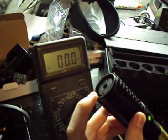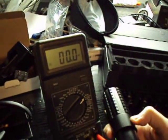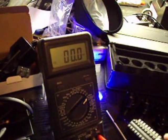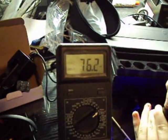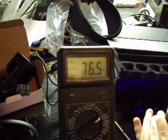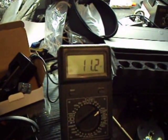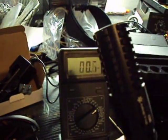Now let's do some measurements. I've taken out the front cap lens to measure the power loss in the lens and the overall power of the laser. Input the code — one, two, three. It's flashing; let's switch to full power constant. My primitive instrument shows about 760 milliwatts, and without the front lens cap it reads 770. I'll take that with about 10% possible error, so that could be anywhere between 700 and 800 milliwatts. I don't think it will go beyond 900 milliwatts total.